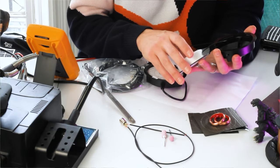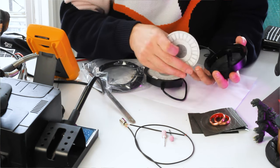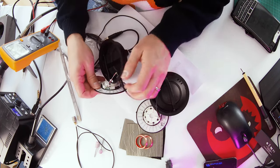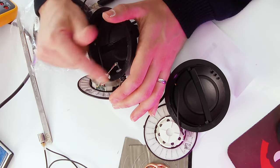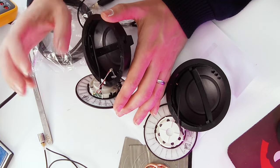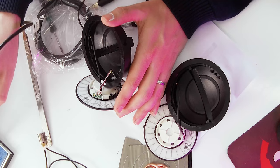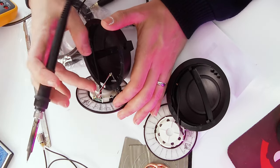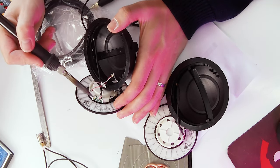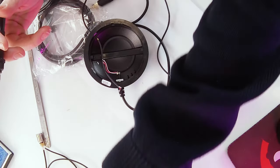The driver pops out pretty easily and this bit comes away from the driver — pop those to one side because we'll reinstall them later. On the cable side you'll notice there are a lot more wires in here. For your own peace of mind, take a picture so you can clearly see where all the wires go — we get a lot of people who pull these apart and can't figure out what goes where. To remove the original wires, put a little bit of tension on the wire and touch the soldering iron to each one in turn — the wire just comes away. Remove both drivers.